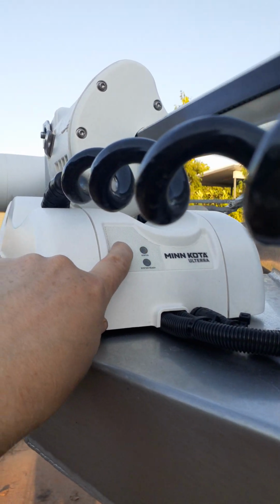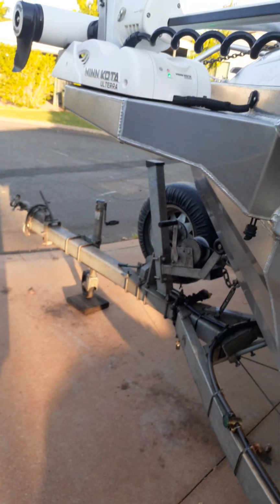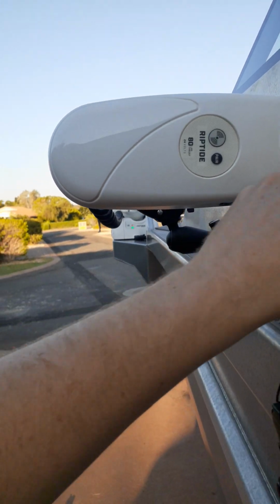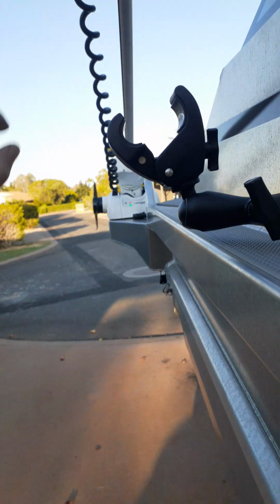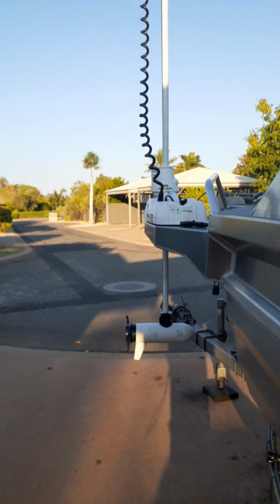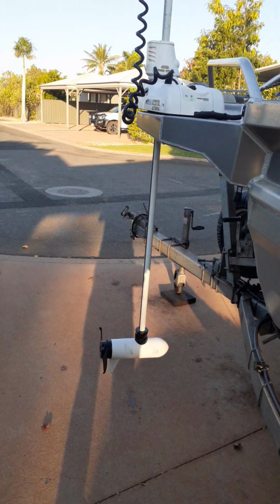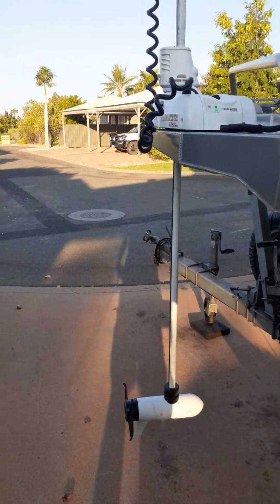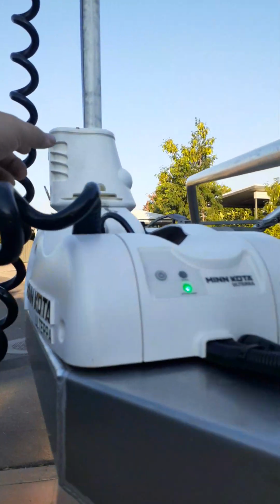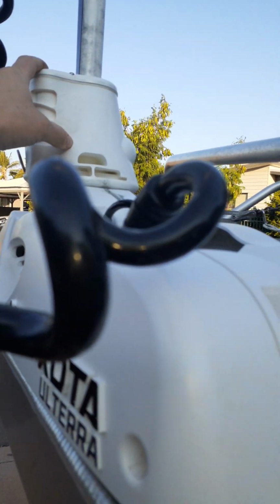So just reset it, and then I'll see if I can give it a push start. That's how I've been doing it. So it went then, but I think what the issue is, the trimmer motor seems to be an issue with it wearing, and then the circlip allows the gear inside to get pushed up against this cover here, and it just locks up.